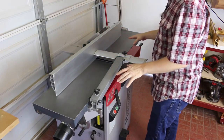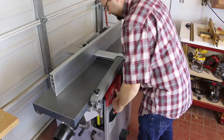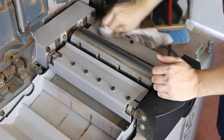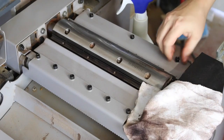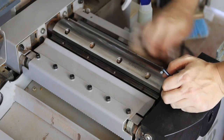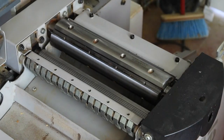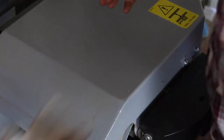Now I'm going to give the top a little bit of time to dry off completely before I put wax on it. While that's happening, let's open this guy up. The first thing I'm going to do is clean up the surfaces around the feed rollers. The next thing I want to do is take off the covers for the feed rollers and clean them. To get to the bottom of this feed roller, I need to take the cover here, flip it over, and come from underneath.